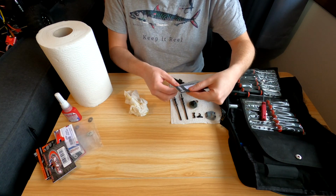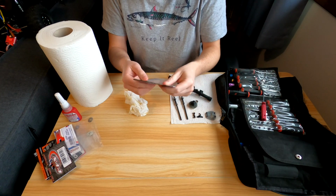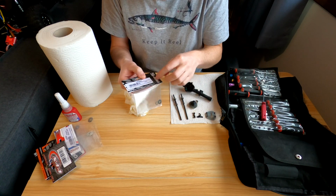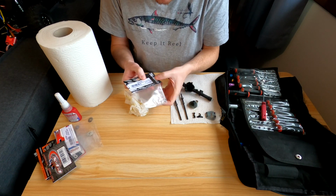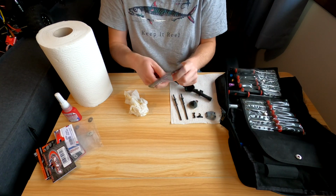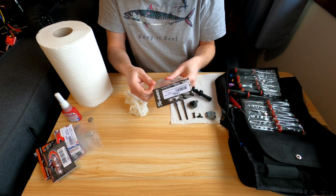Okay, we're going to try these. These are Core RC shims, part number CR453, but essentially 8 by 11 is the sizes, in mil, 8 mil by 11 mil, and they're 0.2 mil thick. So we'll try these ones. I've got my very sophisticated way of opening packets. Right.